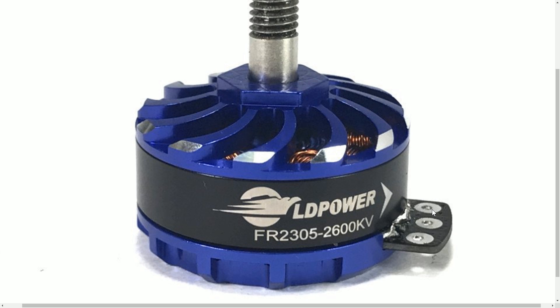Everybody's going to change a motor eventually, though, and it is nice to not have to unwrap your ESC when you go to change out the motor because you can just desolder these pads. It also gives you the flexibility to use a thicker motor wire if you want to, and that might not be a bad idea because these definitely are some amp-hungry motors.